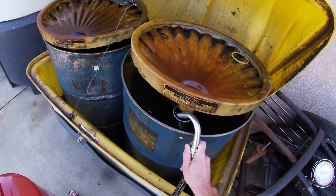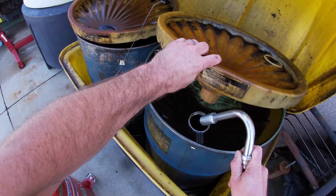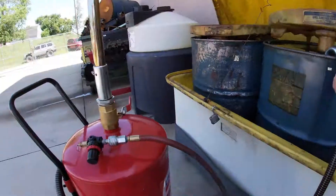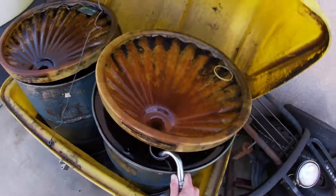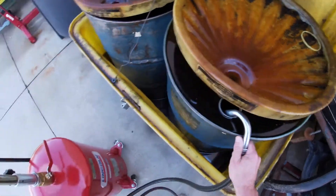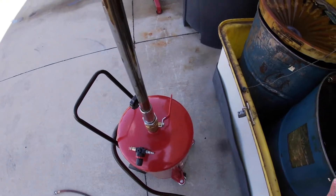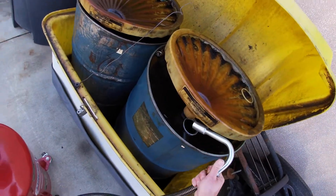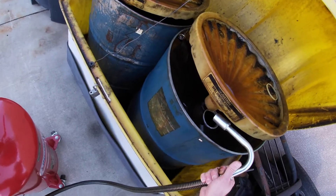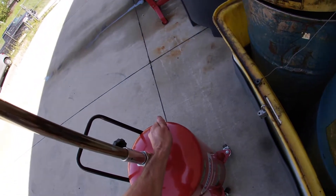I can hook it up now — you can see oil is coming out. When it gets to the end it's going to splatter and really shake the hose, so it's important that I'm holding on to it or have it well positioned. I can now open up my relief and wait until everything bleeds off. It's come down to just a slow trickle. Once enough pressure is released, I can open the ball valve again.